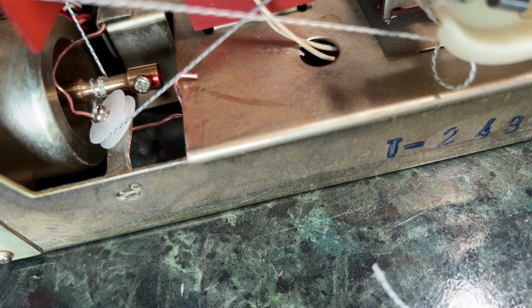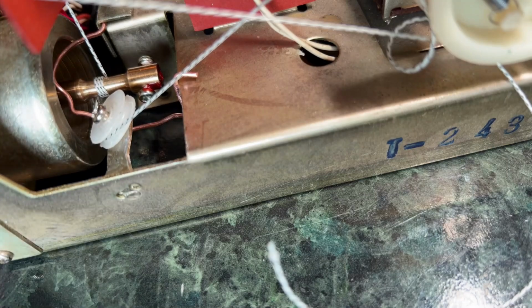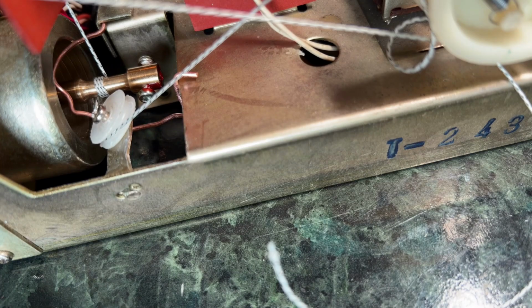So earlier I thought this thing of the wind moving up and down the shaft wasn't a problem, but now I think it is. And having looked at what other people have said, not about this one particularly, but about other tuning mechanisms exhibiting similar faults, I think it's actually supposed to stay where it is. And I think the only thing that can be the problem there is the flywheel assembly and the shaft that it rotates on. And I can't get another one of those.